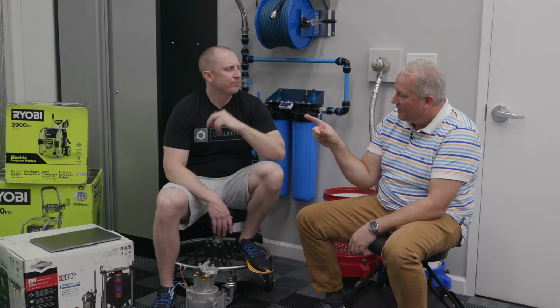Right, time is money, right? So they want the flow. Big commercial grade machines. But to your question, if somebody wants to spend $200, $300, $400 on an electric pressure washer, they don't want to deal with the gas and stuff. They can do like you're showing them, changing nozzles, right? So you can put the large orifice on there and get more flow out of it, so that you can use it for your vehicle. But then when you're doing your driveway concrete stuff, you probably want the higher pressure, right? But also if you just want to use the accessories that are out of the box. Again, a lot of times they'll come with multiple nozzles, right? Like a lot of electric pressure washers come with a turbo nozzle.